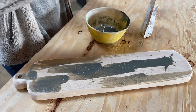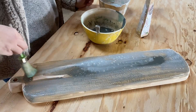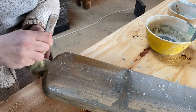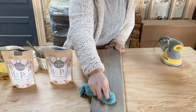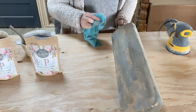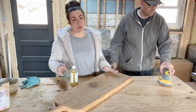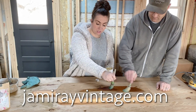Because it's so watered down, it dries a lot lighter than it looks. I'm just trying to create a blended paint finish. The edges tend to be darker, so I'm going to use the zinc along the edges. It's kind of tricky to get it down into the crevice, so I just let it fall down the sides. While it's still wet, we're going to wipe the stain back off with a lint-free rag. You could use black or white and make your own shades of gray — shades of brown and gray are usually best.